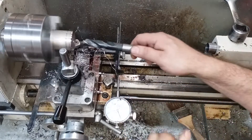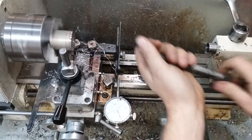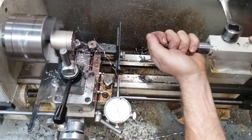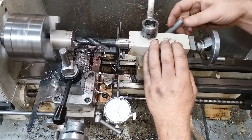I've got an 1/8-inch spotter bit in there and then a 1/4-inch bit, and now I've got me an 11/16ths. It looks like it's almost got a pretty good grind on it. Let's see what she does.